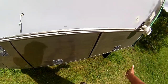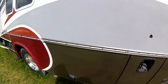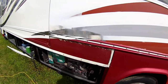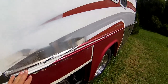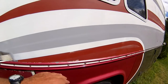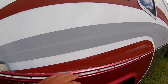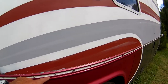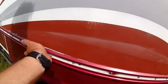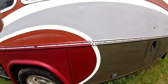I had a big problem installing those because I used stainless steel screws — the owner didn't keep the old ones, saying some screws started to rust, so I was better off putting new ones. But stainless steel is a little bit tricky to install because the minute they jam, you eat up the head. I don't know what I'll have to do — maybe cut through those screws and drill beside them, because they're stuck on the thread now.